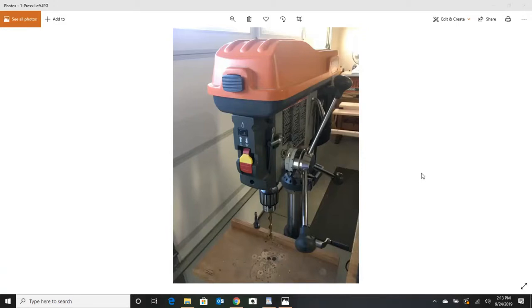This video is going to be on repairing your drill press. The most common failure you're going to have is one day you're drilling into something, you let go of the handle, and it isn't going to retract by itself — that means your spindle return spring just broke. If you own a Ridgid, you're going to have trouble finding one depending on the model, and that can go the same for many manufacturers if they're too old. But don't worry — we're not going to use that OEM spring. I'm going to show you how to fix it for a few dollars more, with parts that will always be accessible.